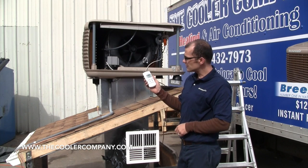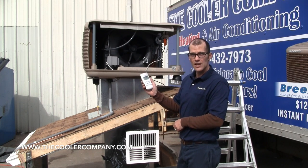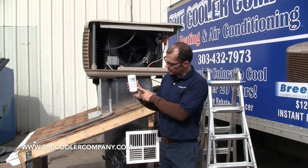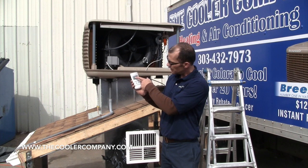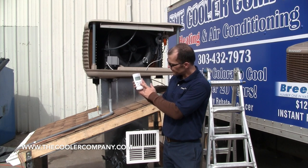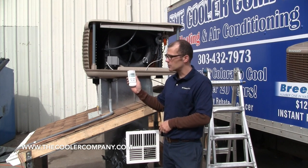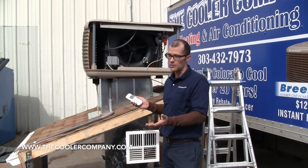Because it's been off or you just took the batteries out, the clock is just going to be saying 12 AM. Here's how to change the time: on the bottom of the remote, there's a button labeled Pro for program. Press and hold that until the hour starts to blink. Set it to whatever hour it is, whether it's AM or PM, then press and release again to set the minutes. Press and release again and your time is locked in. Now your remote is all set up and on the right time, so if you're running it on the timer program, it's going to work with your schedule.